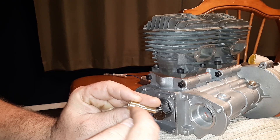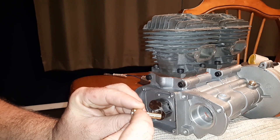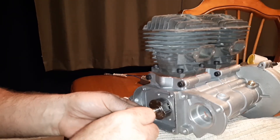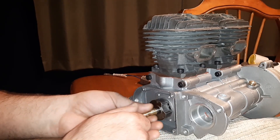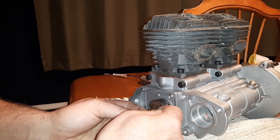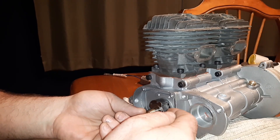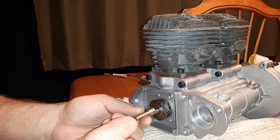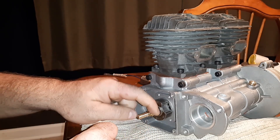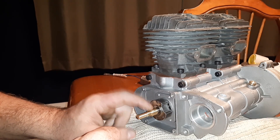I'll drill a hole right now, actually, in this, and then what I'll do is put it in, get it lined up to where it needs to be to get this tight, and then put a hole — like a divot — in this shaft, in the threads, and tap it like an M4 bolt. That way when it's in, you know it isn't going to ever untighten, and it's locked in place.